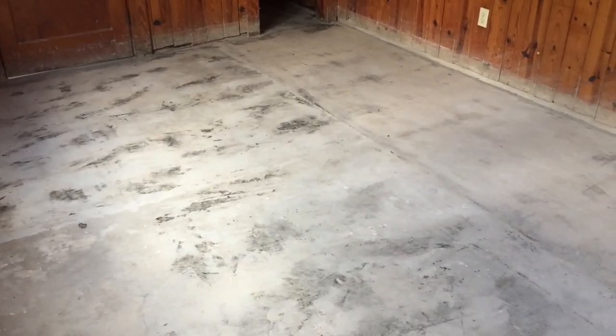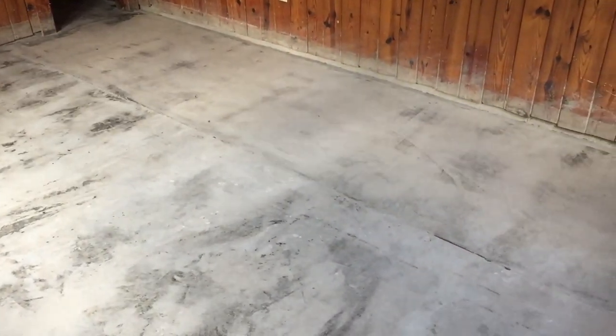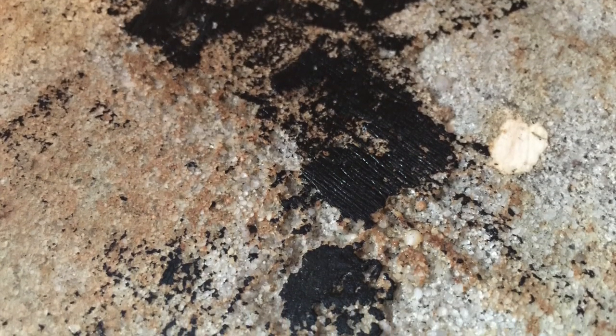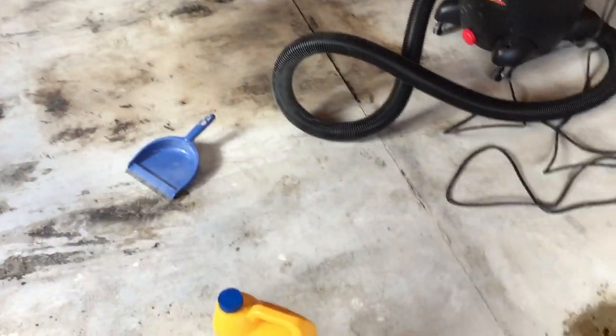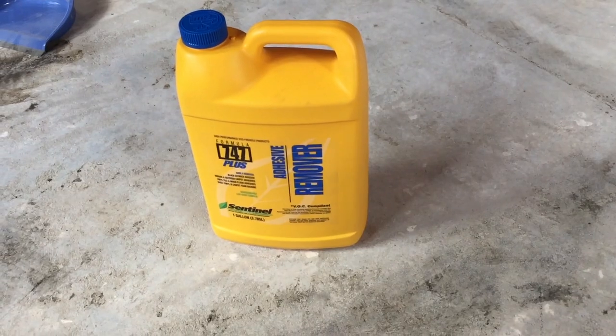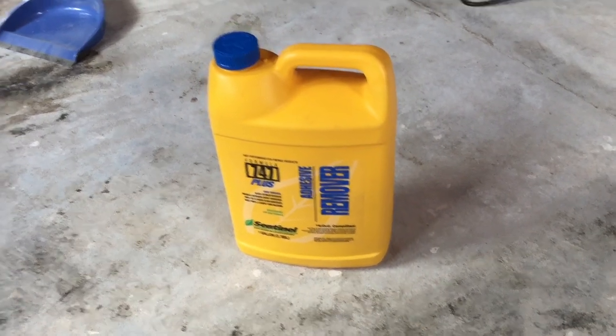This is my process for picking up leftover mastic tar off concrete floors after grinding — about 90% of it. I tried several products like muriatic acid, which I don't recommend because it eats the concrete faster than the tar, goof off which didn't work, and by far the best were a citrus cleaner and another product called Formula 747, which I ended up using the most.